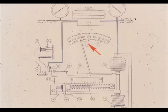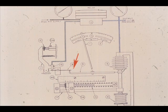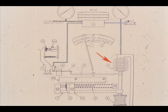Using the schematic for a left-hand mounted transmitter, let's examine its response to a change in level. The transmitter is direct acting and the displacer arrow on the reversing arc points to the right. Assume the level is 25% and the output is 25%, then the level starts increasing to 50%. As the level rises, the reversing arc rotates counterclockwise and the control link moves down, causing the left end of the control arm to lower. The flapper covers the nozzle and the relay output starts increasing.